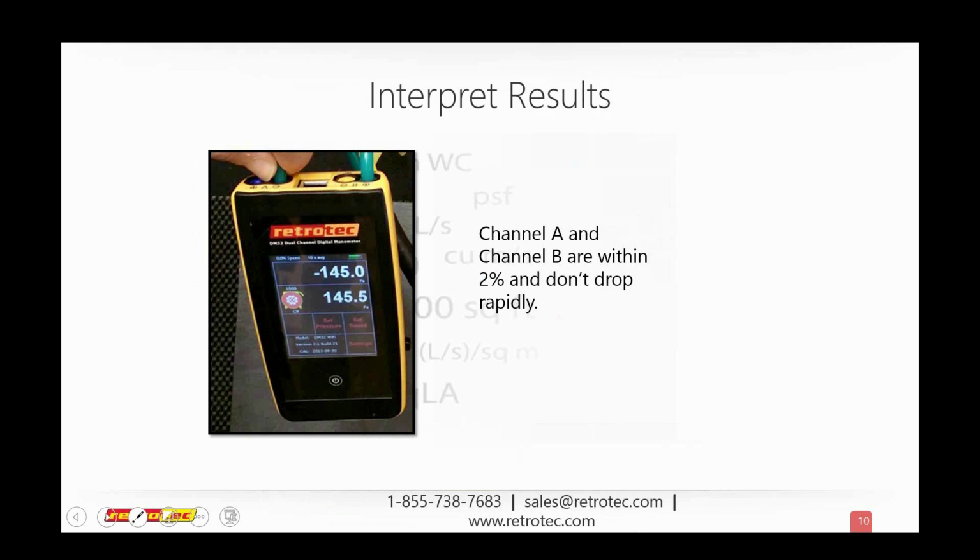So what I recommend is to run one tube through the building and tee that off as often as you need to. You might have a tee and then a 50-foot piece on each side. If you need better averaging, if your baseline is bouncing around too much, you may want to tee that off again and put another two 50-footers on the end of it. Usually the first one is enough. You move that around until you get the baseline pressure across the building, moving as little as possible.